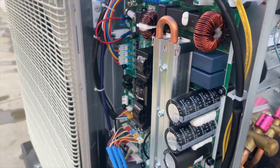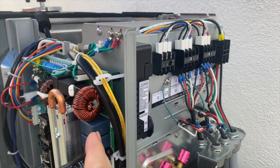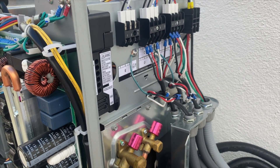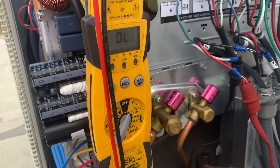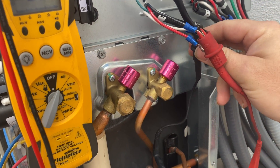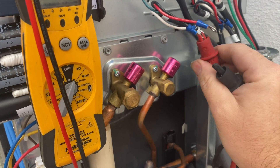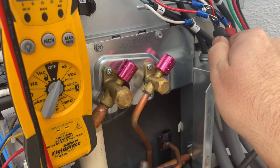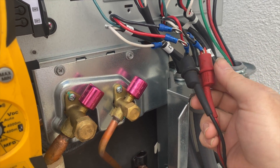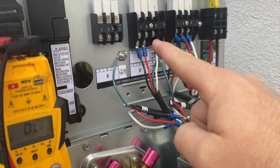I'm going to hook up the two heads with the pumps — I've already rewired them — and then turn it on before I change the board, just in case. But first I'll check for continuity between the wires like there was last time. Meter set to continuity: red to white — nothing; red to black — nothing; black to red — nothing. The last time we were getting tone, which is why it burned out. I've completely rewired it, but I'm double-checking because I don't want to burn out a third board. All checks good.